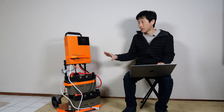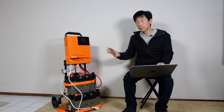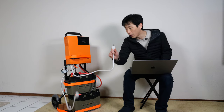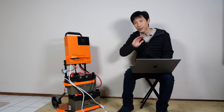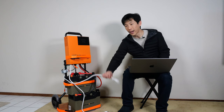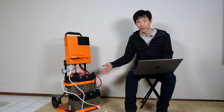The way I'm describing it is mainly to charge only with the sun, but you can just as well convert this into basically a UPS system. If you connect this to the wall, it will bypass all the energy into the output. And if the AC from the wall ever cuts off, it's going to switch very quickly — within 10 milliseconds — and supply power to the AC output from the battery. In effect, you have a UPS backup system.